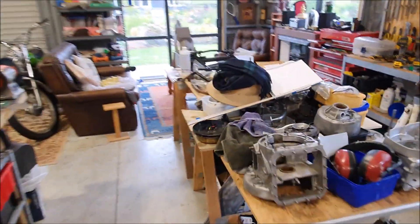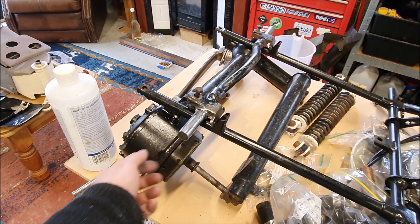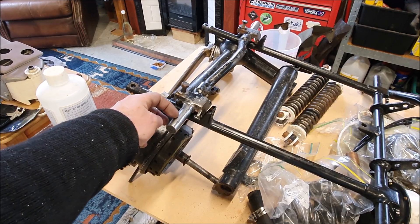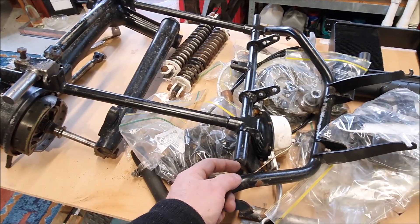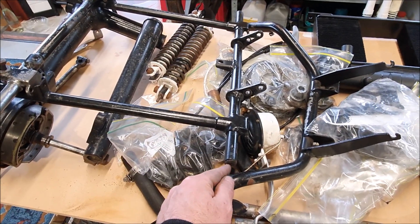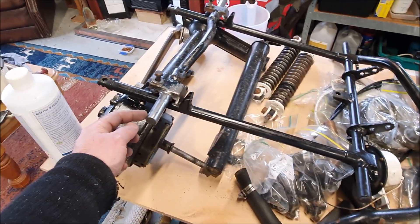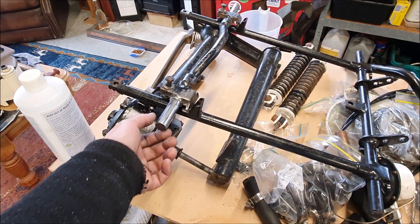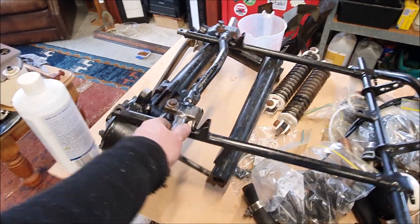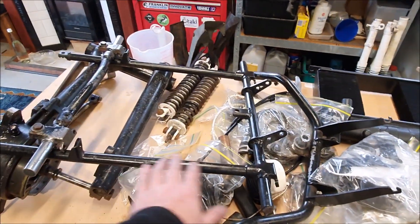I did do a very quick piece on the bike last night — I machined up little end cap pieces to fix where they had cut the ends off the frame. The way this frame works is it's three-quarter inch tube with metal inserts pushed into the ends. I machined up some steel to make a push fit and just plugged up the holes. Still needs a bit of finishing, it's not perfect yet, but I don't think these things were ever perfect anyway.